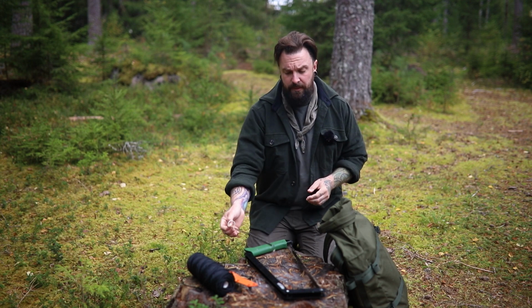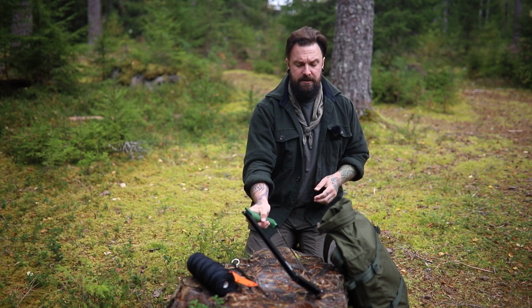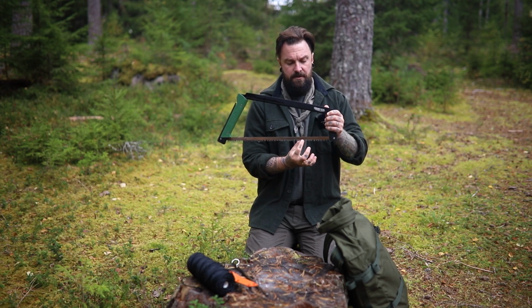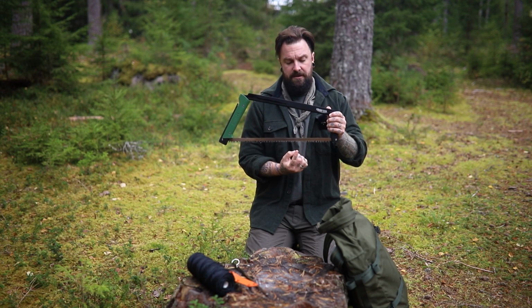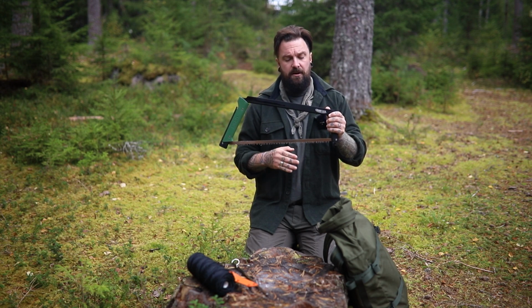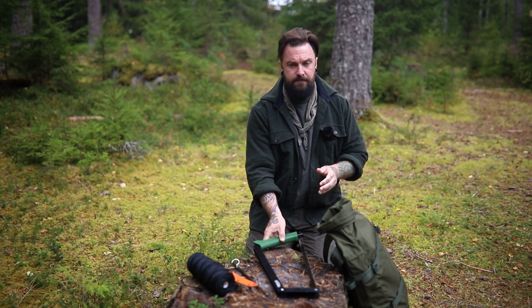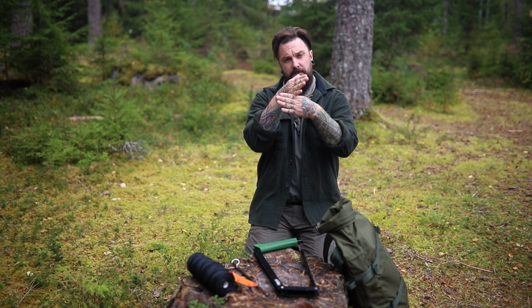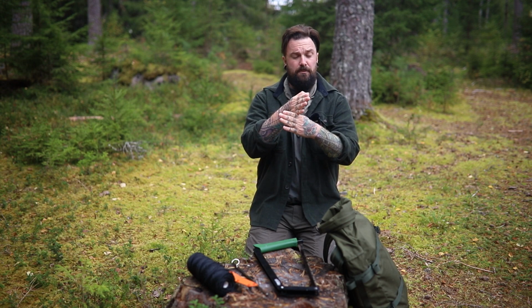Now, what's a greenwood blade, I heard no one ask? Well, a greenwood blade is something like this. So you can see here the pegs. We have 4 pegs and a raker tooth, 4 pegs and a raker tooth, and they're slightly offset. When you hear offset, the teeth can either be offset to the right, offset to the left, or they've been cross cut, for want of a better word.